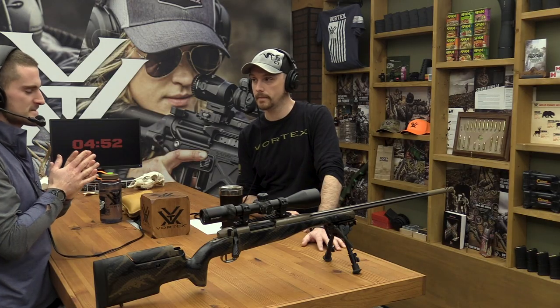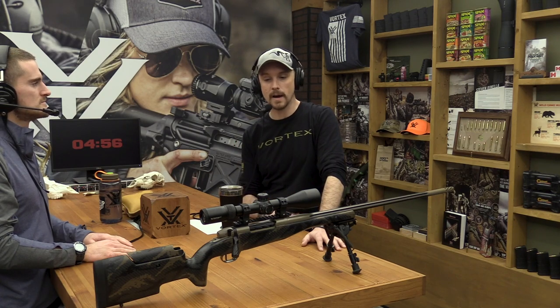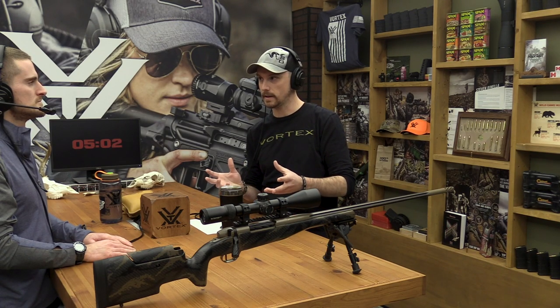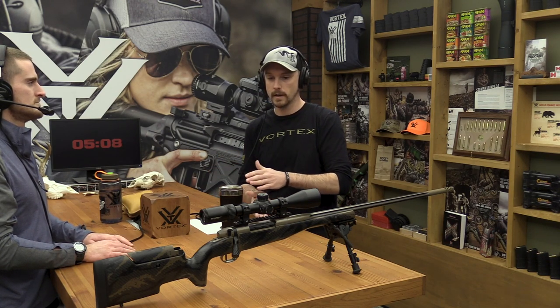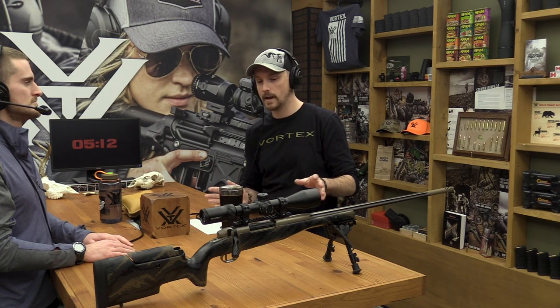Absolutely. One last thing I'll throw out there too. Can a 20 MOA base be used with MRAD scopes? 100%. Yes. So when we say MOA or MRAD, that's a really common question too, actually. In fact, we get that a couple times a month. Folks call up and say, I bought an MRAD scope, can I put that base on there? You can convert MOA to MRAD, a simple calculation, and vice versa. All we're doing is biasing that scope. It's not going to affect anything else.